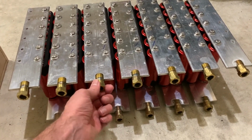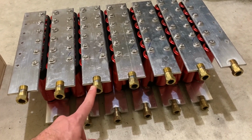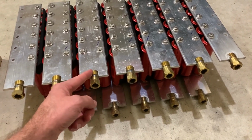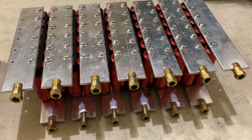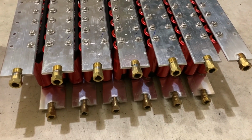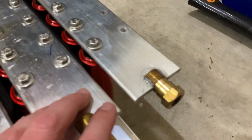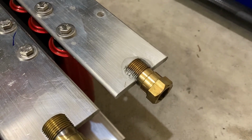So Dinse quick connects. These came out of a bunch of panel connectors I got on either Amazon or eBay, and I took the shroud and the nut off of it, and I milled a slot in each of these so that it would fit real tight over the bus bar. And then I used Al Solder 500 to solder these brass connectors onto the aluminum bus bar. And that stuff just worked great. We can focus here. Yeah, it flowed in nice, made a really nice connection.